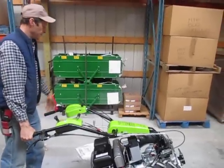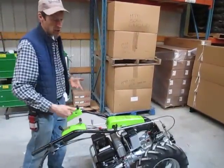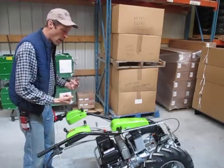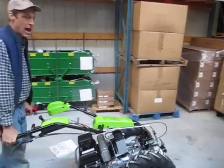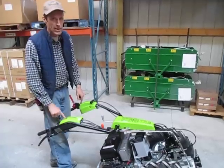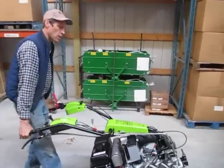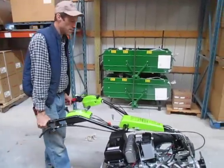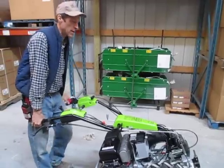Press the safety release down and I'm driving. If I want it to stop I'll let go. Now obviously there's nothing on the front of the machine so I'm having to lift a lot of weight — typically you'd never be using it this way. This is your forward reverse selector — pull that back and when you press the clutch it backs up, in the same gear you were going forward in. This lever selects the speed, this one selects the direction. Always disengage drive before shifting speeds or directions, otherwise you're going to hear funny grinding noises — not too good for your gearbox.